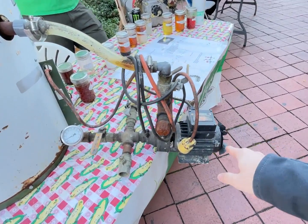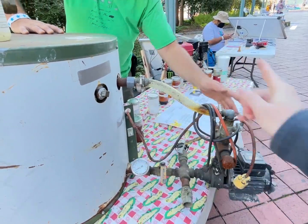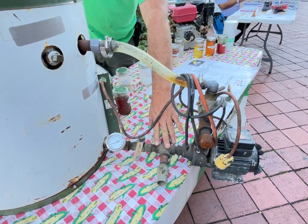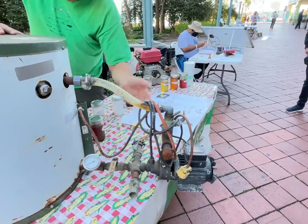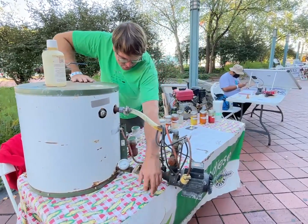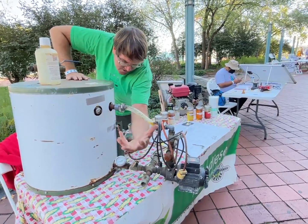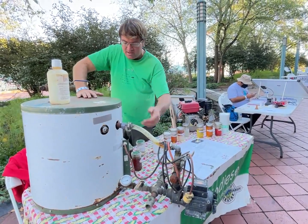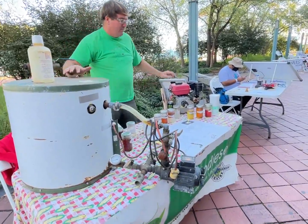So is this a pump? This is just a cheap pump from Northern Tool — it circulates, but it actually does everything. With the way the valves and T's are set up, I can use this pump to fill the reactor. I pour in the methanol and potassium hydroxide solution directly through a funnel elbow, let it mix, and then when I want to empty the tank I close this off, open this up, and pump it into whatever collecting vessel I have.